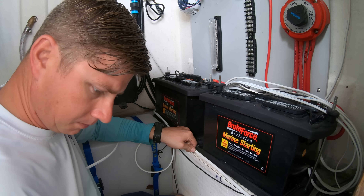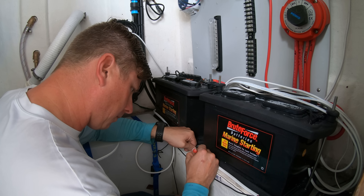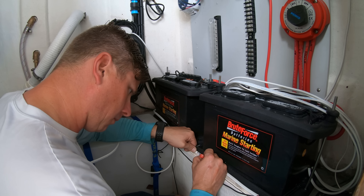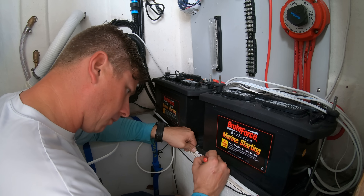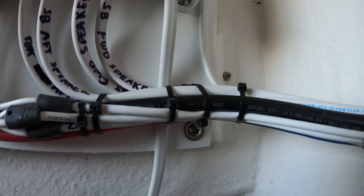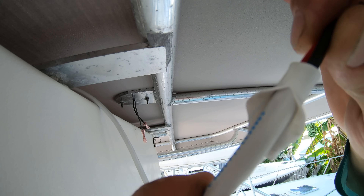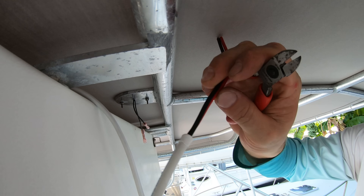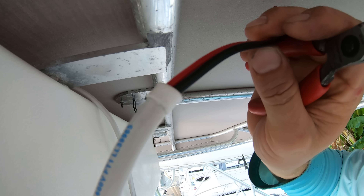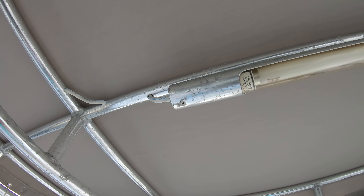You'll also want to make sure you don't forget to take a Sharpie and mark all of your wires as you pull them throughout the boat. I like to label them all individually as they get pulled, so that there is a tag on each end telling exactly what and where that wire is going. Depending on the time you have, you could roll the ends of the sheathing if you use a 14-2 gauge duplex wire and then trim it off to give it a nice clean roll at the end of the sheathing — depending on how clean you want the install to look.